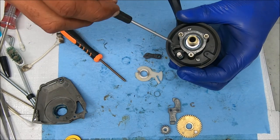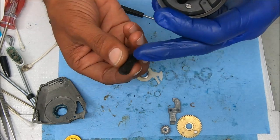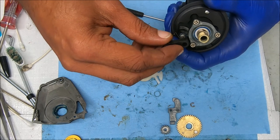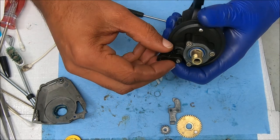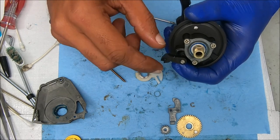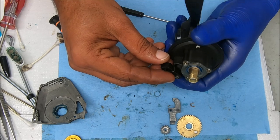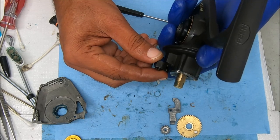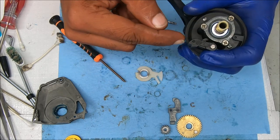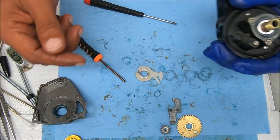Now, if you'll notice, there's a little blockage right there. There's a post on the bottom here that's going to ride inside there. So the way to get this to sit is simply put that and the double bend edge through that channel right there on the dog. Have it raised slightly so you can get over that post or that channel, and then go down. Now you're set in place. You want to make sure the dog is facing out towards the rotor, but that's essentially set.